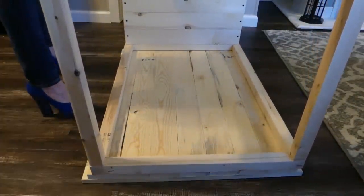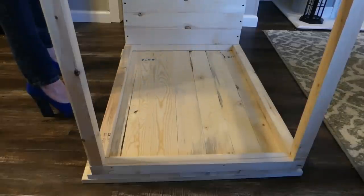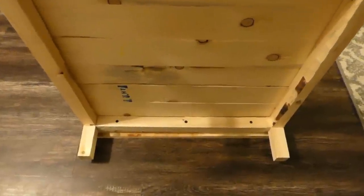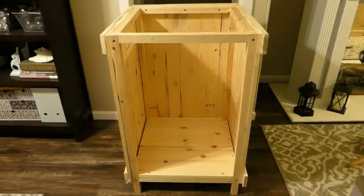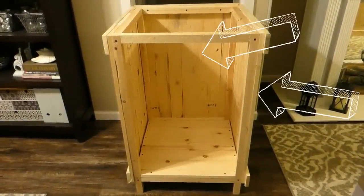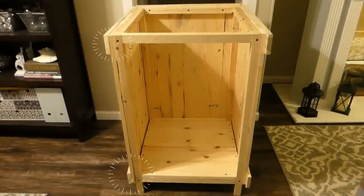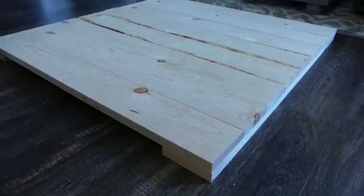Once the sides and the door are assembled, lay the frame down on top of the first side. Line up the top of the frame with the top of your side and secure in place with the 3-inch screws — I'm using three screws along the top as well as three along the bottom. Since my door will be opening from the right, I'm attaching the two sides with extra on both ends to the right and back of the frame. The left side will be attached so the no-extra end sits flush on the frame.